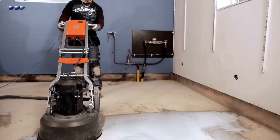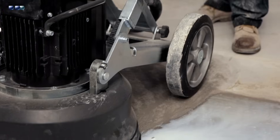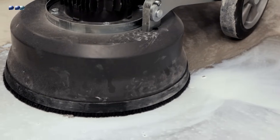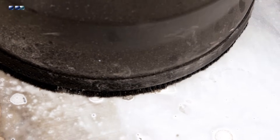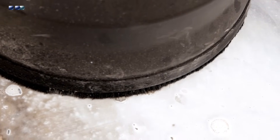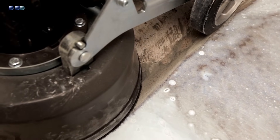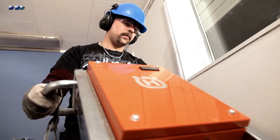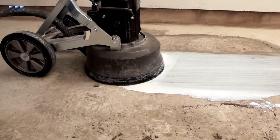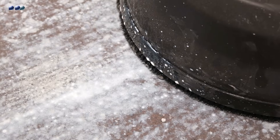Third, while still wet, run the machine with 120 grit diamonds through the wet GM3000. The GM3000 will combine with the dust created by the 120 grit diamonds and it will be forced into holes created by air bubbles and extracted aggregate. Finally, the floor should appear slightly blue after completing an area. When using GM3000, work in areas of 2 to 3 meters squared until a feel for the process has been established.